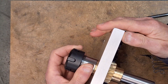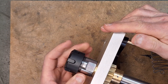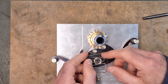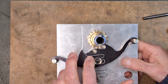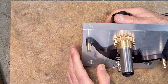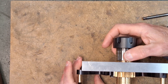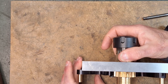You can see I've got a working ratchet there. Switch it across and it works the other way. Even under its own weight it does function, but I've made up a spring to make it a bit more secure. So that just snaps into place. Those recesses in the retainers just hold the spring so that it can't come free again. You can see that just snaps a little bit more positively into place. If I switch it across to rotate the other way again, you see it just snapping down into the teeth. Nice and safe all being well.